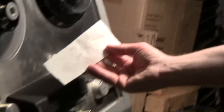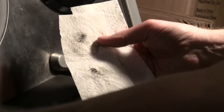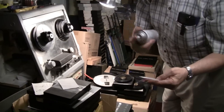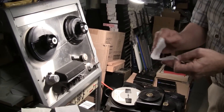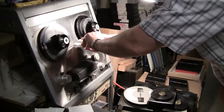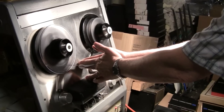This removes all the migrated binder - that's what has come off, which is very minimal. Some of these are much more severe examples, and some even more so - that crusty gummy material. This tape came out pretty simple. Even tapes found in a hermetically sealed vault that have never been opened - I've had three from the Army Corps of Engineers, a helicopter flyby of seashore damage due to a hurricane. They had never been rewound, and two of them were fine but one was a stinker.